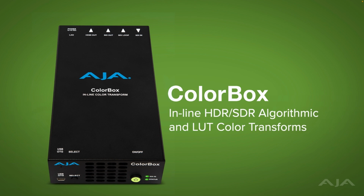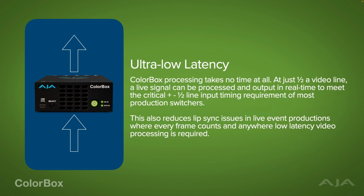Now, let's get back to our topic today, which is the ultra-low latency performance of the ColorBox. ColorBox processing takes no time at all, at just half a video line. So this meets the input timing requirements of production switchers, so sources stay in sync without any delay. And this feature is also extremely important wherever lip sync is a concern and when live needs to be live.